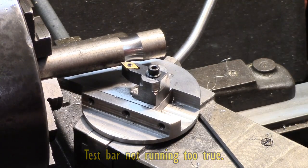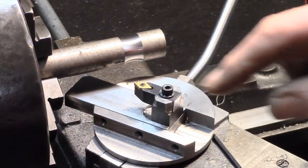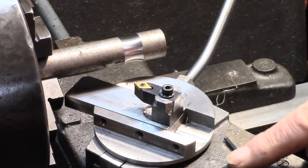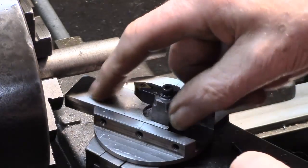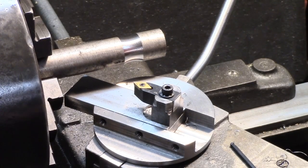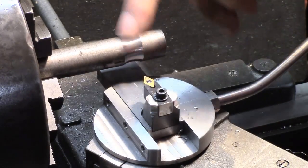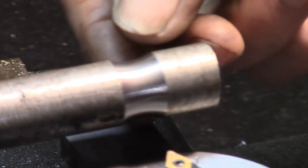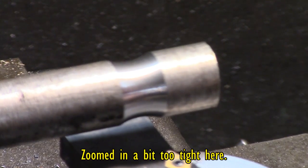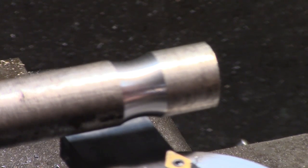I've got the option to do a bit of concave, but I can't go a lot different on radius because I can't move this too far — I'll be in the way of the chuck. So this has all led to some thoughts on a different tool post, possibly another version of the sliding piece, to make it more versatile within its limitations. It won't get used a lot but that cutter is actually doing quite well on there, so there might be the odd application where I need a bit of back radius. Several things need to change, so at some point I'll give you a further update if we get some improvement, although I've got other projects to get on with. Anyway, for now thanks for watching.